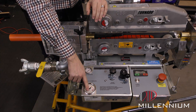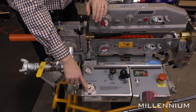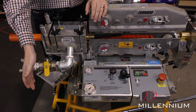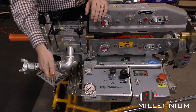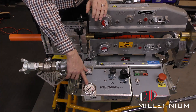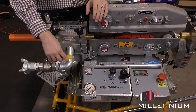What you want to do is watch your pressure gauge down below. As that starts to rise — somewhere around 400 feet — start cracking open the air real slow, and just keep adding air to keep your pressure down. You don't want to be full blast until you're towards the end of your run. As you're going along it'll need more and more air to keep the pressure down, and by the time you get to the end it should be at full blast.